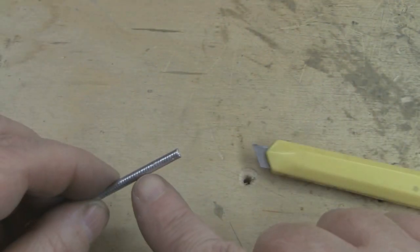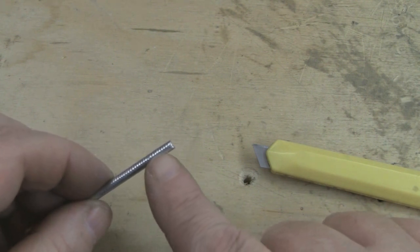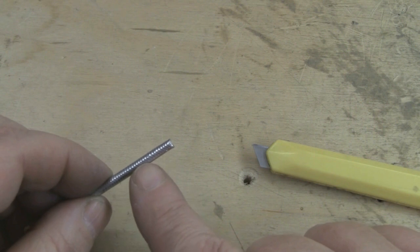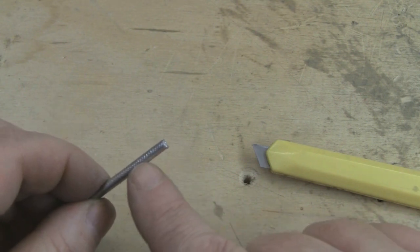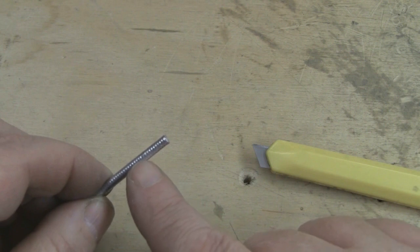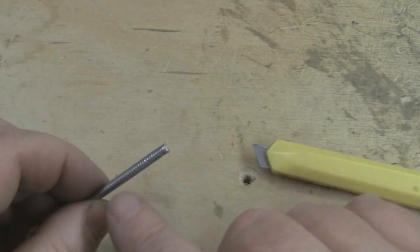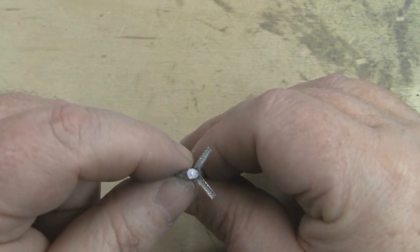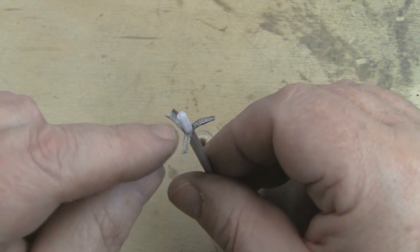Next, we need to score down three times, evenly around the diameter of the outer braid of the coax, so we can bend it back on itself. We can then solder one half of our elements onto the outer braid and the other half onto the center connector at the top. The outer braid needs to be cut and bent back on itself — aim for around 10 millimeters deep. Bend them back and space them out nice and uniformly at roughly 10 millimeters.